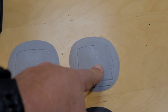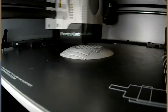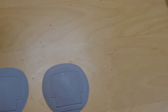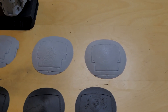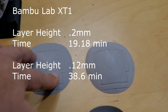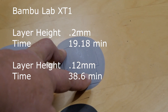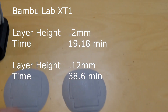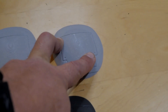This one I did without adaptive layering but reduced the layer thickness to 0.12mm — it reduced the rings a lot, but it added time to the print. The first print at 0.2mm took 19 minutes and 18 seconds, and switching to 0.12mm upped it to 38.6 minutes, almost doubling the print time.